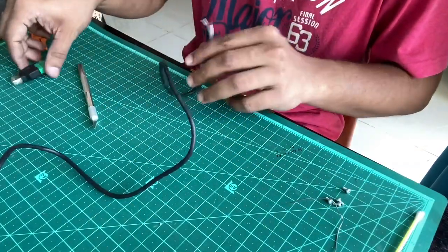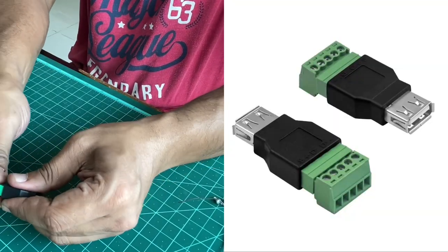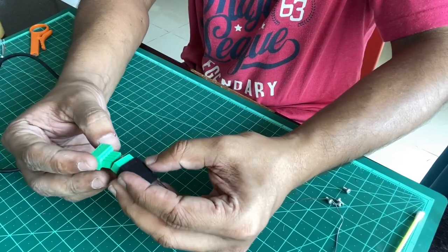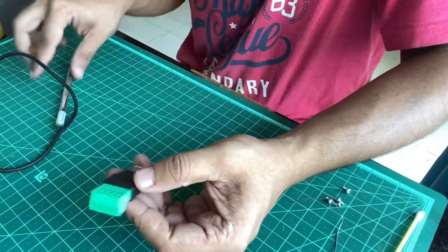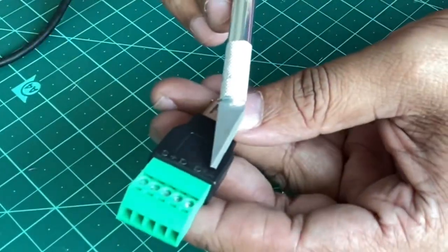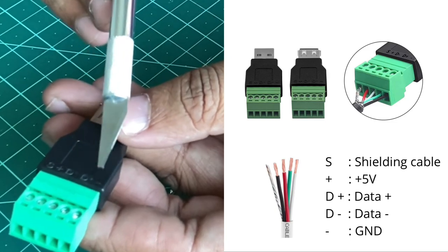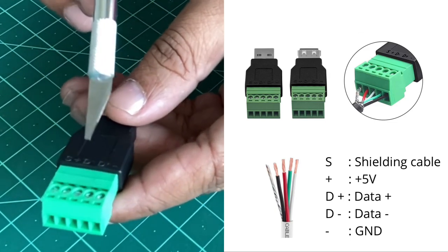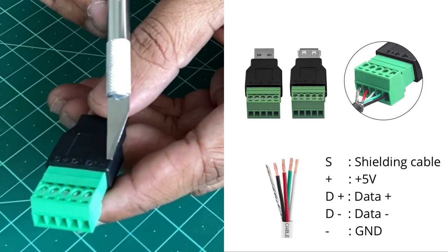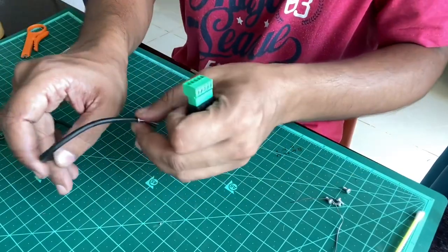The other end is going to be connected to this female USB connector - it is a screw type terminal which comes off for convenience. They have clearly marked all the different leads. We're only concerned about these four and can omit the fifth lead. Ground is negative, data plus is green, data minus is white, and positive is red. We'll just connect these terminals to it.